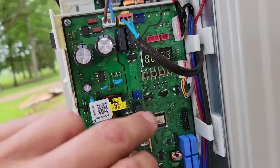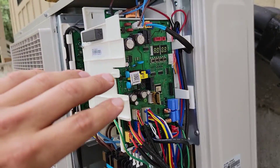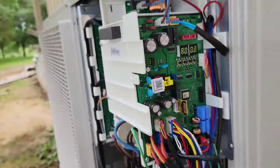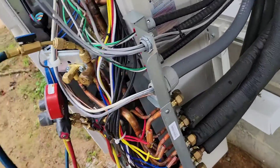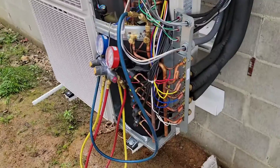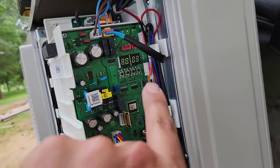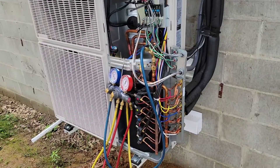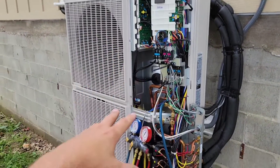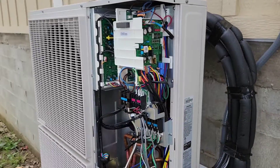This right here is the board with the dip switches: K1, K2, K3, K4. I love Samsung because they have an auto address feature. When I start up this equipment, I push the K1 button and it does a pipe check — an auto address — so we know how many indoor units we have. Push K1 twice and it automatically puts the unit in cooling mode, so you don't have to go inside and set every thermostat to cooling.